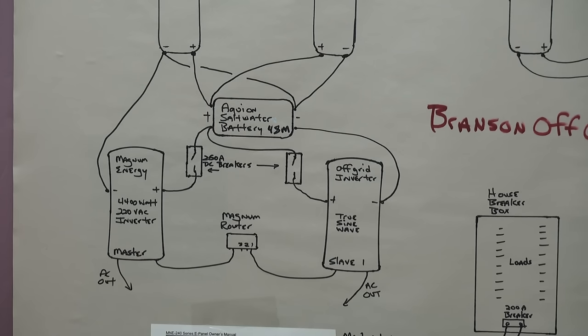In a completely electric home, the hot water heater is on a timer and only comes on between 10 and 3 when you've got the most sun, offsetting the power it consumes. Cooking is generally early morning or late evening, so splitting things up helps. Between 10 and 3, you've got full sun with all that power coming in. If your battery charges up and you're not using it, you're wasting that incoming power. The whole key to any off-grid system is really battery storage.